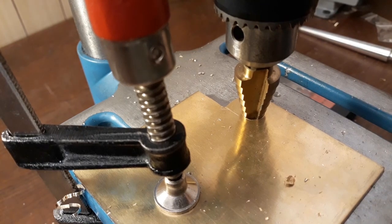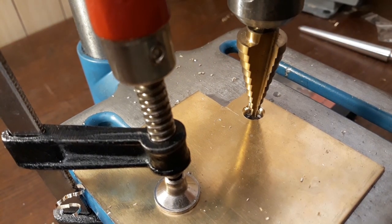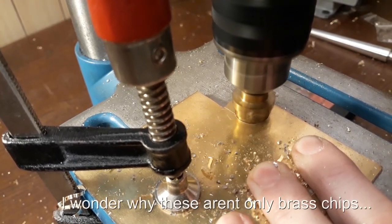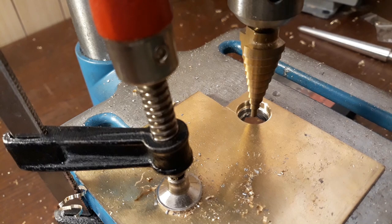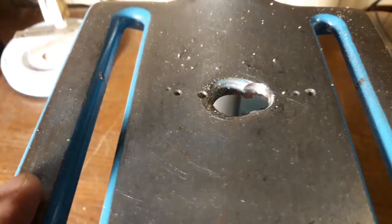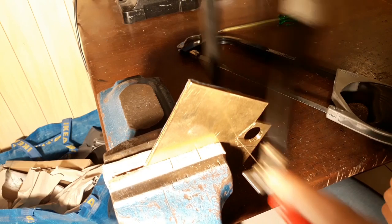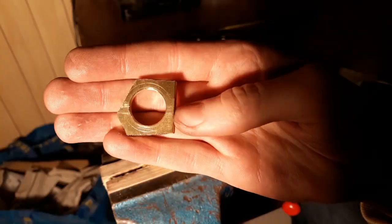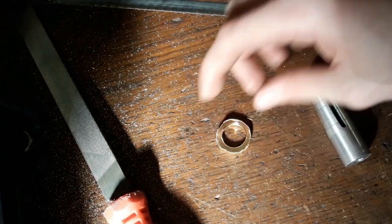Step drills really require a lot of torque, and this machine really isn't made for this kind of thing. You can discuss whether that actually worked well, but the hole is pretty good. I guess I know why this poor little drill press conked out on me — I wasn't actually cutting all brass, I was cutting the table. I've actually used a file and a hacksaw and a coping saw to get this very rough ring shape out of the material.